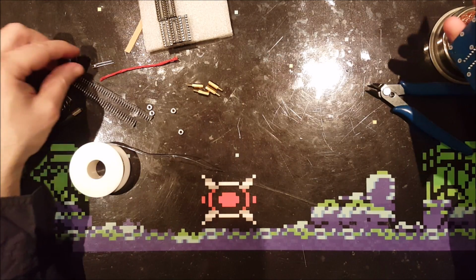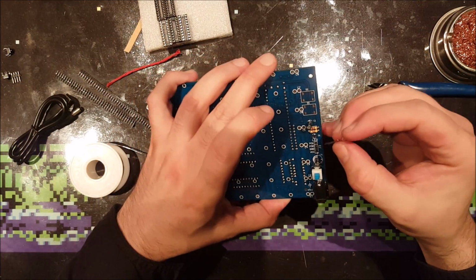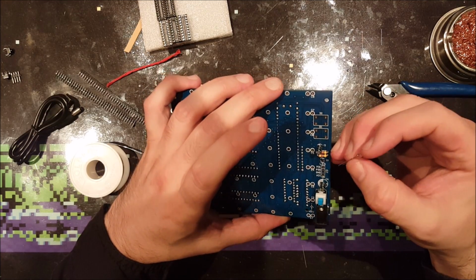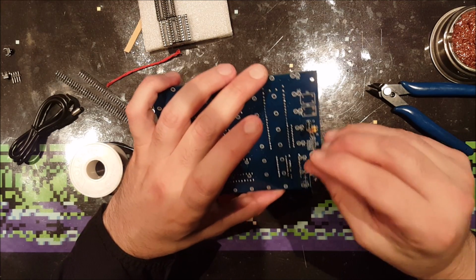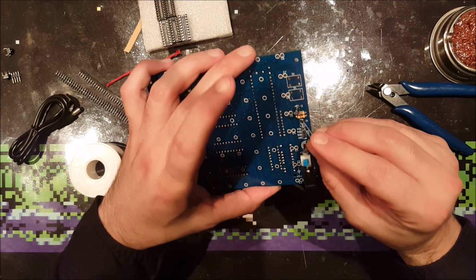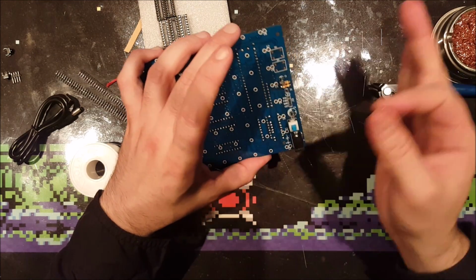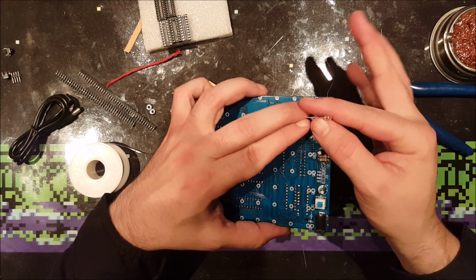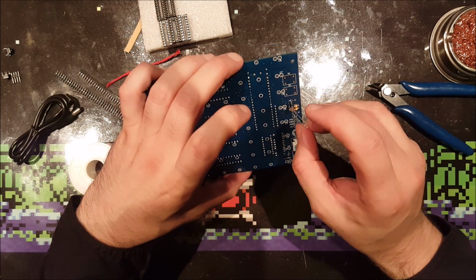Do I have any components left? The white LED, my favorite white LED. And it has a plus and a minus sign, and it's not exactly clear, probably. Yeah, so again, the plus is the longer lead, and this one has a plus marked at the top and a minus at the bottom, slightly out of the center, so I guess, of course, this is the correct position.